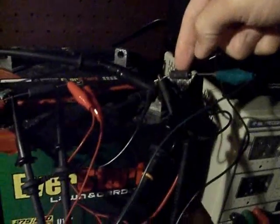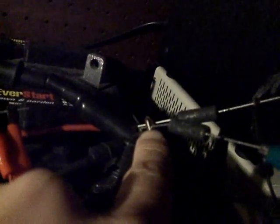This right here is measuring the current for the load. And this black wire is going directly to the negative rail on the timer circuit. So all four probes' grounds are tied right there at the negative terminal on the battery — literally all within about a half inch of each other. So there's no resistance in wires it's going through — these are accurate measurements.